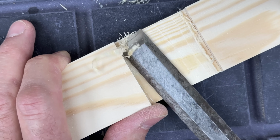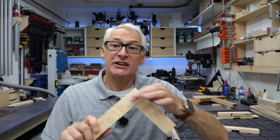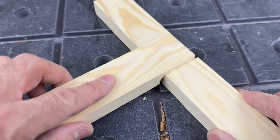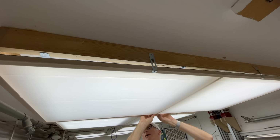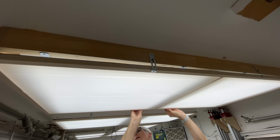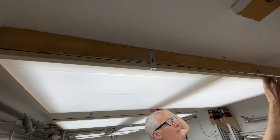You can use a half lap L joint anywhere where you want a workpiece, a frame say, to be a consistent thickness, and a T-joint for a frame cross member to an upright. I used half laps when I made the thin frames for my light diffusers a while back, and they're still going strong despite being up in the heat of the ceiling and right next to the warm lights all day long.